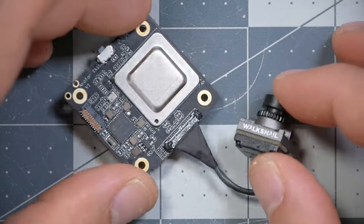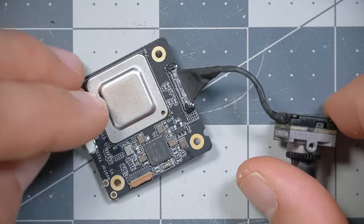As far as I can tell, this is just a normal Walksnail video transmitter with the heat sinks removed and some changes to the voltage regulator to make it run off 1S. I've compared photos of this board to others who've taken heat sinks off their regular Walksnail VTX and they look very similar. The basic capabilities are the same: 1080p output, 50 and 25 megabit per second options, 100 frames per second video, onboard DVR — all exactly the same functionality. The one difference is it only goes up to 350 milliwatts, not 700 or 1200 like the bigger one.